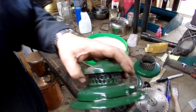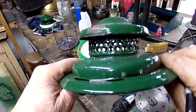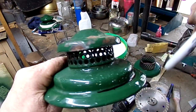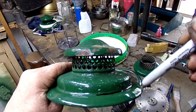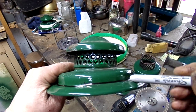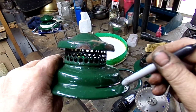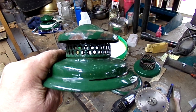The trick is to make your cut just right. I have two lines here — one line is perpendicular to the side, and the other line goes down at an angle. This is how you want to make your cut with your wheel. If you cut straight in perpendicularly, you're going to lose about an eighth of an inch of shade for your blade width. But if you cut at an angle coming in, you're going to be a lot better off and save more of your shade.